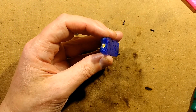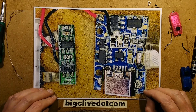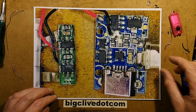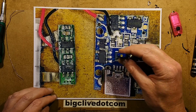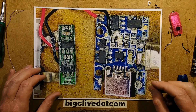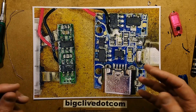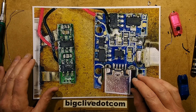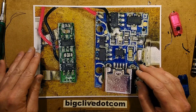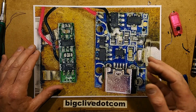I'm going to pause and take that screw out. And rather predictably, there are significant signs of corrosion. It turned out there were two major points of corrosion in this, because I have fixed it. One of the faults was relatively easy to find; the other was really not easy to find. So initially I gave these circuit boards a clean. I used a toothbrush that I keep for cleaning circuit boards with methylated spirits. I prefer isopropyl alcohol, but it's quite hard to get over here because shipping it requires hazmat shipping due to the fire risk.